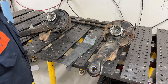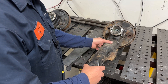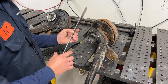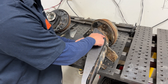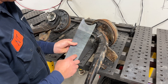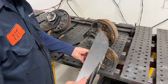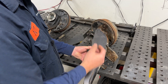The more I take apart this VW Bug, the more I like it — a lot of the parts just seem to work really well together. Here's the trailing arm. I just cut the arms off and now I've got to come up with a plan. Let me show you how this works. You have two identical plates that follow the profile line of that whole seam right there. Then you've got this other plate that boxes everything off — it's already bent and fits in here. There will be a little shaping needed to get it to sit nicely so I can TIG weld it.